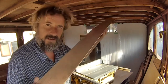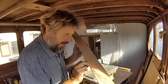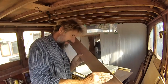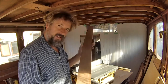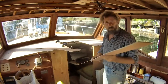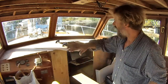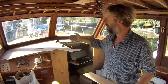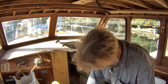There is just the slightest one-sixteenth-inch chamfer on there — relatively uniform. As I lay down each plank I may have to just skim it with a sanding block to make sure it's uniform, but I'm really pleased with it. Instant planking! With just a few minutes at the chop saw with the angle set for just about 15 degrees on both sides, I'm doing a dry fit — laying them all out. Then one at a time I'll cut them, square butt-cut the back end off. I'm loving the way the chamfers look.